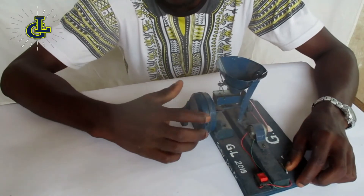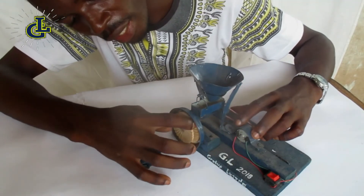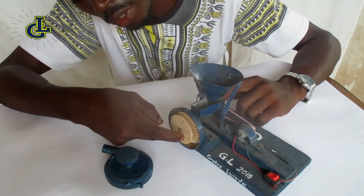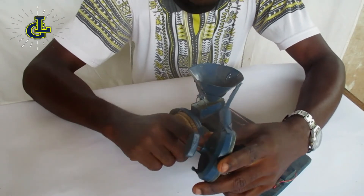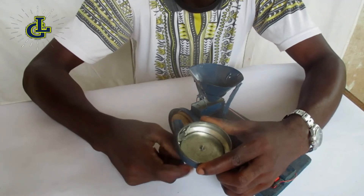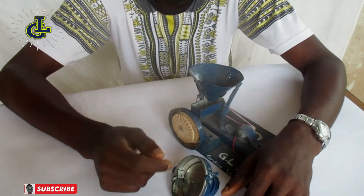I'm going to open this up and let's see what's happening in there. So over here I have two teeth — one which I glued onto the container, and the other rotates with a shaft. While the motor propeller rotates, it rotates the shaft, and the shaft rotates the other teeth. On the cover I have my adjuster — there's a bolt in there, whereby if you turn the upper part of the vertical container, you see the bolt coming out. What it does is this bolt pushes on the other teeth, making them get closer together, so the intervals close up — that makes the media grind.